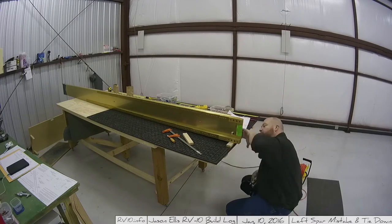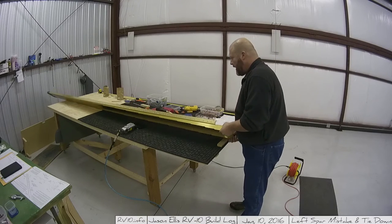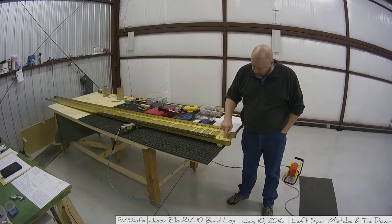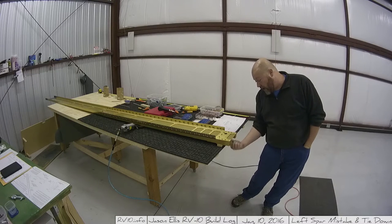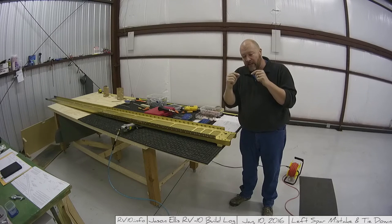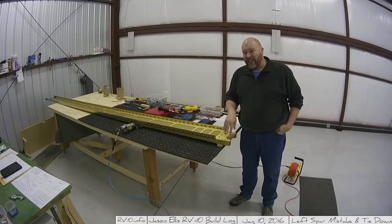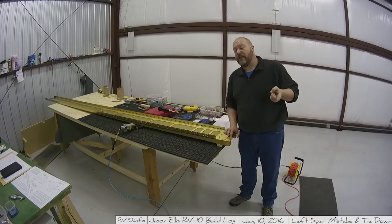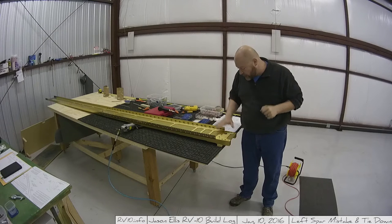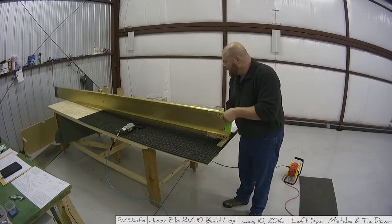I did address the mistake — made some phone calls I didn't get on camera. I called a buddy and said, 'Here's what I've done, is this going to be okay?' He said it'll be fine in this area because I'm countersinking thick metal, and accidentally countersinked the wrong side of another thick piece of metal. There's enough material between the two pieces that the countersink didn't remove much. You put the rivets in and you'd never know. He said if it were thinner metal it would be a problem since countersinking both sides removes a lot of excess material, but with thick metal everything is fine.